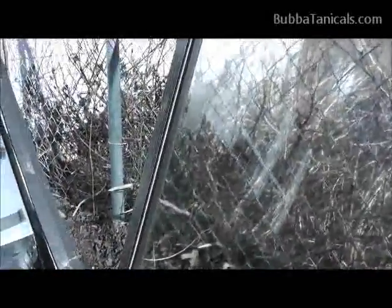The glazing — which isn't on here right now — is nothing more than a storm window we got off Craigslist for about five bucks. The heater is built out of pressure-treated pine with a three-quarter-inch backing, and then there's half-inch rigid foam insulation on the back, painted black to absorb heat. We've also got three layers of aluminum screen, each layer about three-eighths of an inch apart.